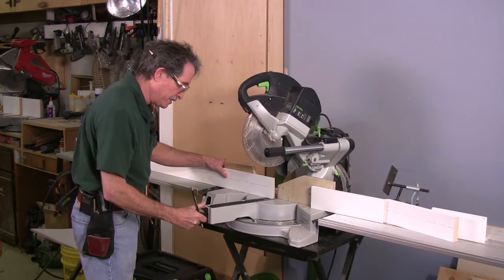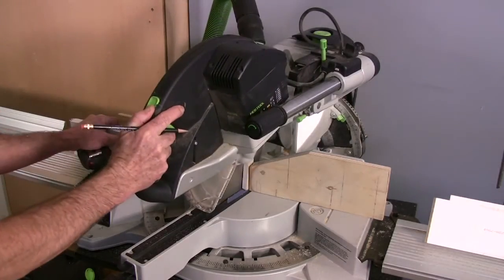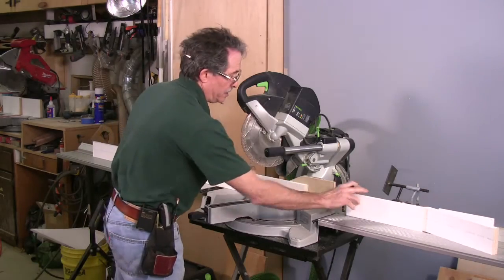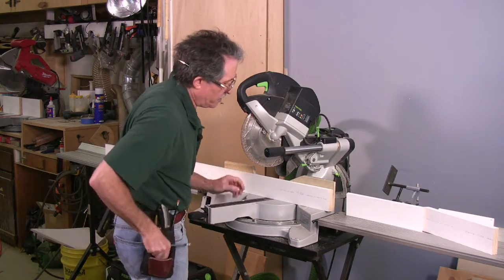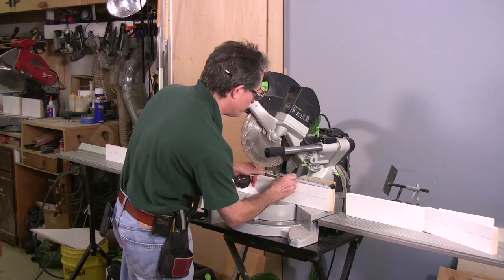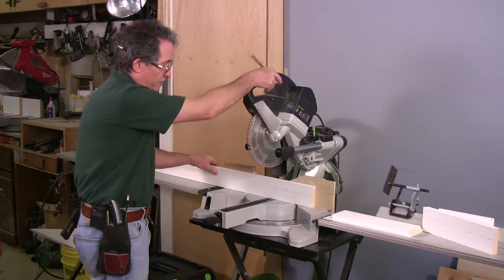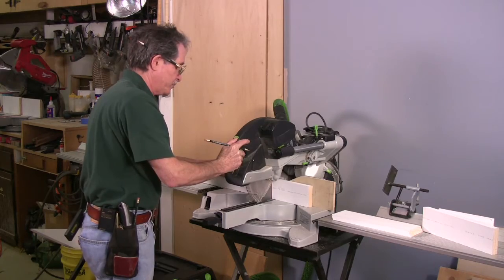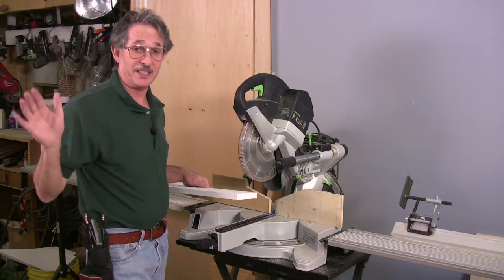First, we have to cut the mating miter to come out of that inside corner, because that inside corner is the last one we had to cut, and we want to pull from there 8 inches to the back of this molding. And this now is a butt cut. Well, that finishes all of the pieces going up and down the cap.